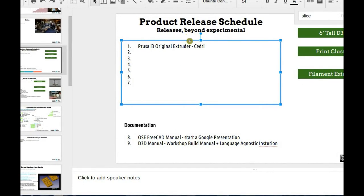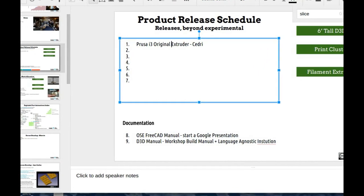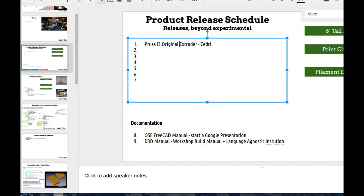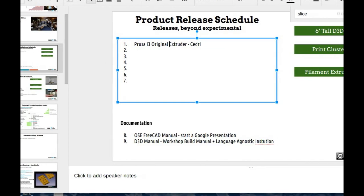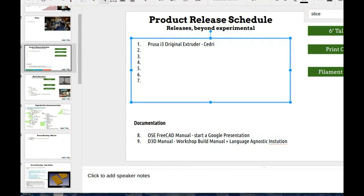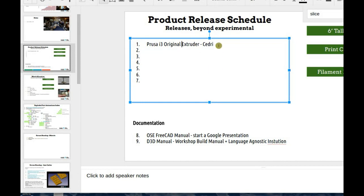So I would like to go to 3 millimeter as much as possible, especially when we go to our garbage grinder that takes all our plastics and possibly does this kind of bulk printing filament, which is a mix of all plastics, and you need a very large nozzle to squeeze it through, because it might have rat hairs in it and whatever. And those rat hairs will be good for fiber reinforcement of your plastic lumber anyway, so that's good. But I think the bigger filament is definitely good.